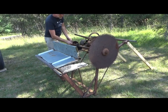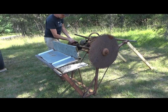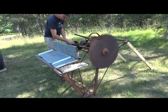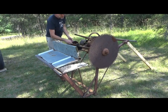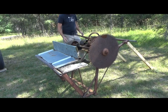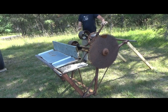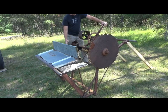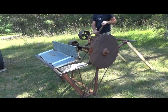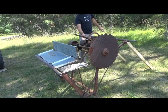And it looks like, I don't know if that's supposed to be open to the outside world, but I can see the bearing directly. I'm probably gonna put plugs in that. Or not the bearing, the shaft. You can see the shaft through here. I'll probably put plugs on that. There's a bearing in here, there's probably a bearing in there. And that'll keep the weather off. And then here you've got a tensioner pulley, which you'll then slide to engage the drive belt to spin your blade. That gives you tractor time to warm up. And when you're ready, you engage it. And there's a tensioner on here to lock it in place for running. And then you can disengage your drive belt and lock that back down.